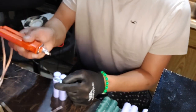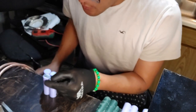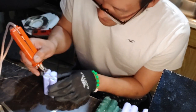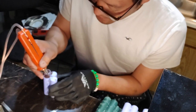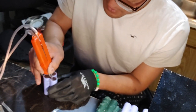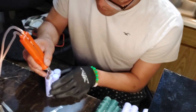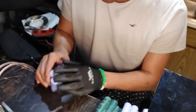Next, go ahead and grab this. When you spot weld, here's an important point: make sure you don't press down too hard or too soft — somewhere in between. Press down on it and you should get a nice weld. I like to start on the right and go to the left, all the way. I'll also get the edges — basically the edges of the battery. Once I get the two edges, I'll get two edges from the other direction. This way, if the battery is being pulled laterally or horizontally, you have a different weld orientation that won't come off, instead of just doing it in one direction.